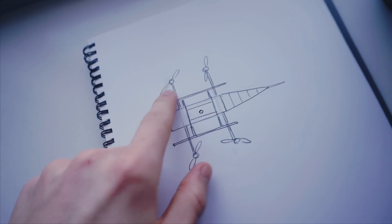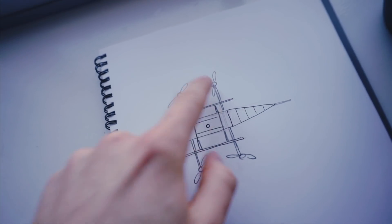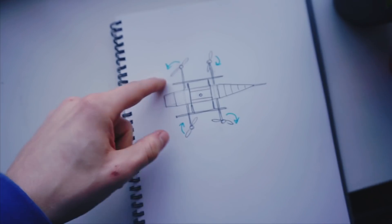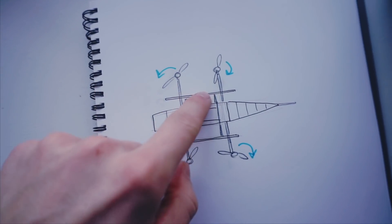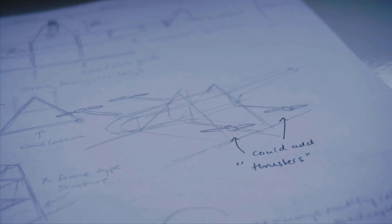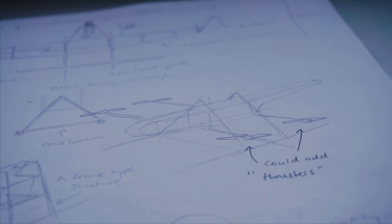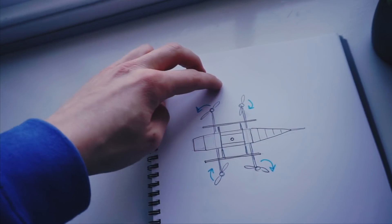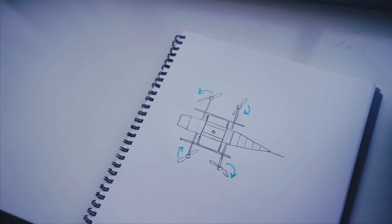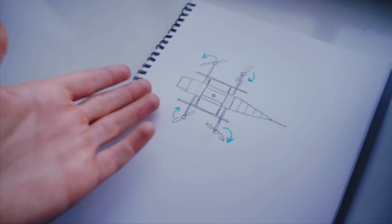However, I have thought of a new idea which doesn't involve any sort of gimbling head mechanism, and it is a little bit more experimental. So up first, my idea might look like I'm cheating, but these are four quadcopter-type motors. These motors will be attached to the fuselage — this is the fuselage here from a top-down view. The rotor will be on the top, and these will only spin when you want the helicopter to actually start manoeuvring. If you want it to bank to one side, then you can increase the thrust on one side of the helicopter. Just like a quadcopter or drone does.